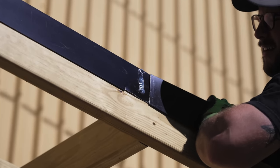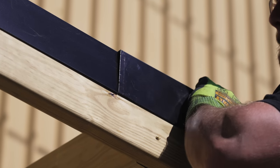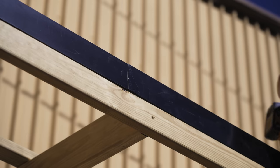I added a bead of silicone where the two pieces lapped to help seal out water. After adding the caulk, I slid the notch section of the first piece of trim into the hem on the second piece, locking the two pieces together. This not only looks good, but keeps the pieces from flapping around in the wind. Finally, I could nail off the piece of trim and move on to the next piece.